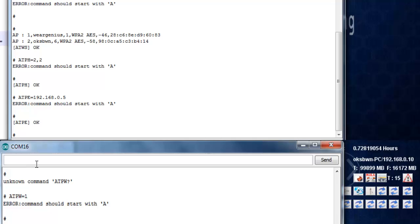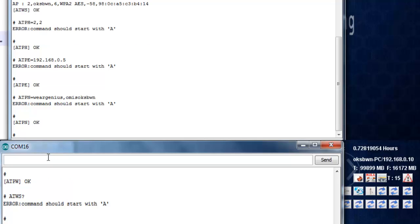If your network provides IP via DHCP, you can use AT+PH with the mode and parameter 1 for DHCP. All these codes are available in the PDF provided by Pine64 for more details. To connect to a desired network, use the command AT+PN followed by the SSID and then the password. After it returns OK, you have successfully connected to that access point.